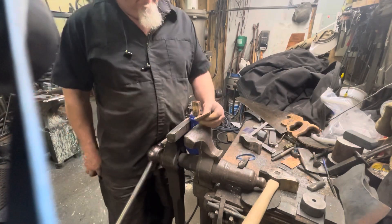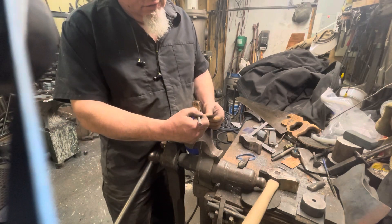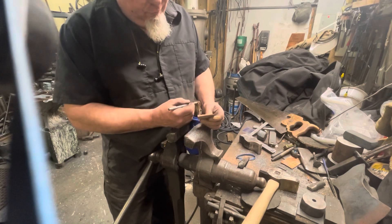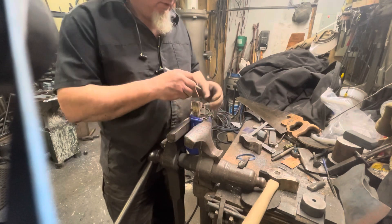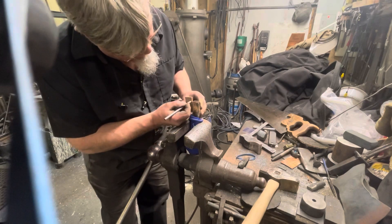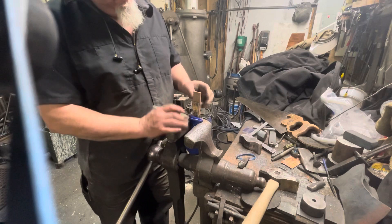I made my wedge from walnut. My belt grinder is two inches wide, so my taper runs from my finish depth to almost nothing over that two inches — I don't want it actually sharp. I'm going to mark my final depth on the slot because I don't want to keep pounding the wedge in past that point, which may split the wood underneath.